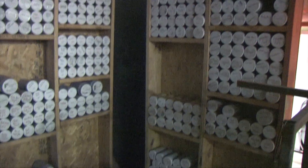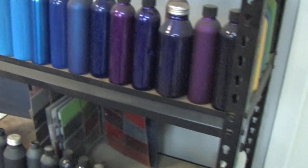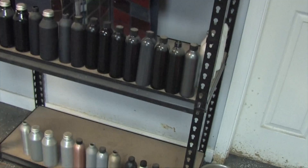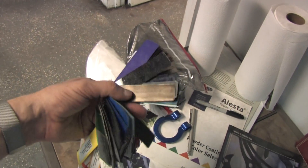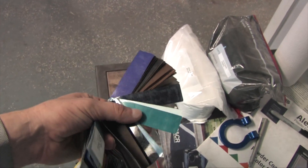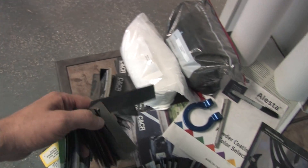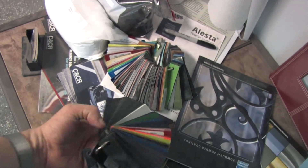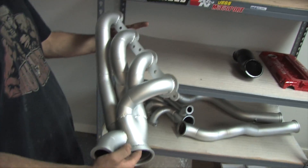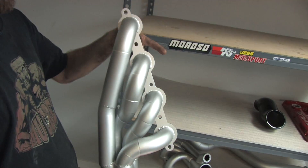So what are the brands of powders that you use? Mostly Prismatic — through the highest quality and the biggest selection. How about the types of powders? You do the regular old powder coating stuff, but you also do ceramics? Yeah, ceramic — we use Cerakote. It's a high heat application rated for 2,000 degrees. We use it on a bunch of turbocharged applications, mostly the DSM, Evo, and Turbo Hondas. Anything that sees heat, it's a good insulator to keep the heat in and get it out faster. This is a CTSV manifold in our silver Cerakote, capable at 2,000 degrees.